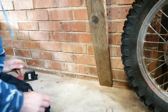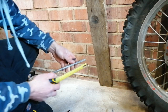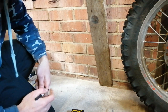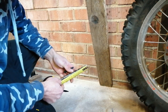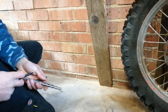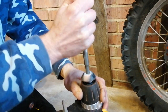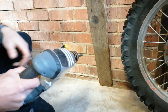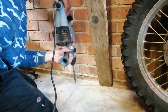So there are the pilot holes done. There's quite a bit of dust when you're doing this, especially drilling into concrete, so you might want to wear a mask. I've now moved on to the 16mm drill bit. I'm going to mark where seven centimeters is so I know how far down I need to go when drilling - I don't want to go all the way through. If you haven't got an SDS drill, I highly recommend getting one - it goes through walls and concrete like butter.